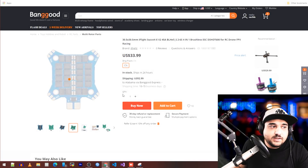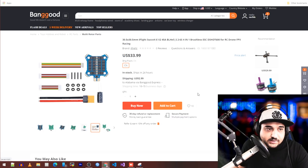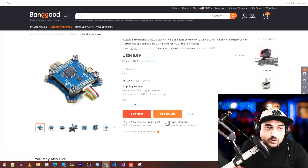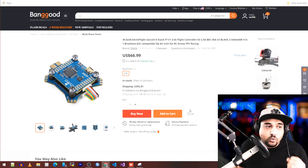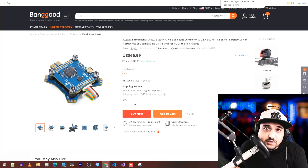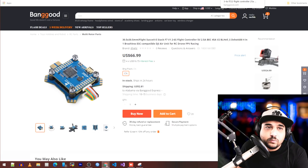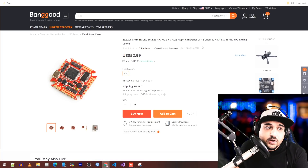I'm being very hesitant recently to recommend anything — I'm asking myself, would I actually buy this? I don't think I would. I'd probably go with a Mamba. The new Mambas are absolutely reliable across three quadcopters at different levels. For T-motor ESCs, I'd wait a bit — the 45A is the best from my testing, while the others seem to have firmware issues or wrong dead time.